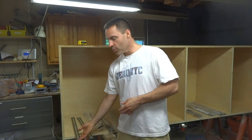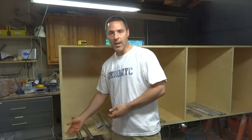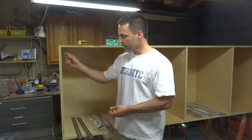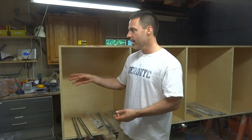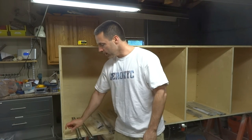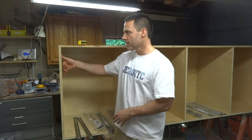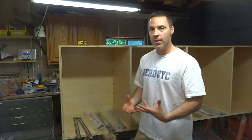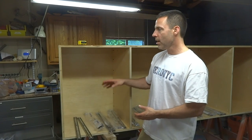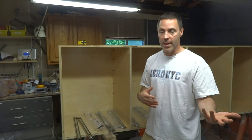I'm going to attach the drawer slides in the next video using a slightly different method, but nothing that you haven't seen already. I really prefer the spacer block method, although I showed you the story stick or story pole method. If you've watched the kitchen video series, I've shown you how to do that. This is going to be a little bit simpler. I'm going to cut some spacer blocks. I'll lay down a spacer block, attach a slide, use a spacer block, the next slide, spacer block, the next slide. So in the next video segment, we'll talk about how to get this installed and how to make some very simple drawer boxes out of already the scrap plywood that we have.